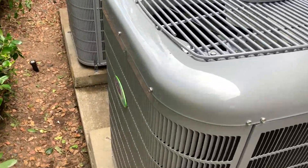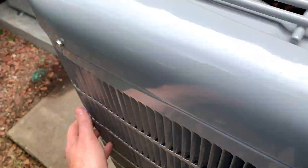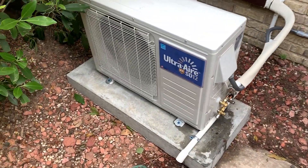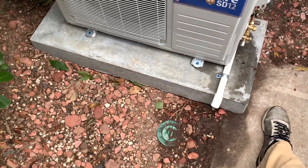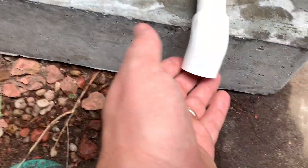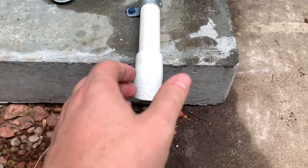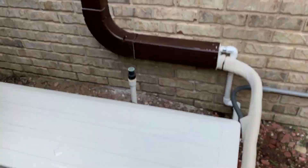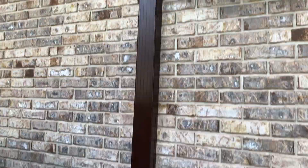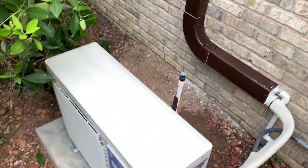Here is one side of the house. We did two of these Infinity units on this side of the house — the house was having a lot of moisture issues. We installed an UltraAir SD12 on it. It's draining a little bit in fits and starts; we have a P-trap on it but it's acting like there's static pressure holding it back, so we may increase the trap depth a little bit. This is the line cover — we painted it to match everything else. Needs a little touch-up painting, but it's turning out pretty good.